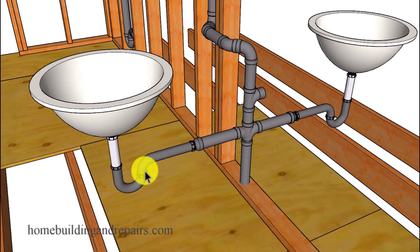If you imagine removing this section of pipe so you can get the snake through, you'd hope it goes down, but in reality it's probably going to go across. Almost every plumber has a story about the snake going into another room and creating problems for the bathroom on the other side of the wall.